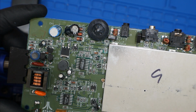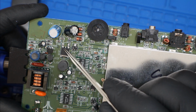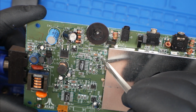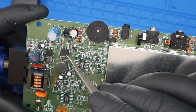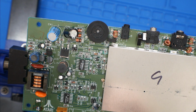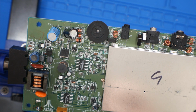So what we'll need to get removed and replaced will be this Zener diode, these 2 transistors, and this MOSFET. And then additionally, potentially, this resistor. So that's R74, D13, Q12, and what's that? Q7 and Q8. And you can also look on the Console 5 website, because they will say install instructions and where the pieces are located. So if you're doing this on an Atari Lynx 1, you can just look at their website and see where the corresponding components are. Everything should be labeled on the board, so it should be pretty straightforward.